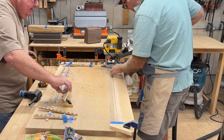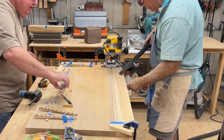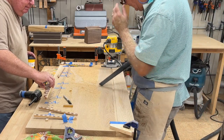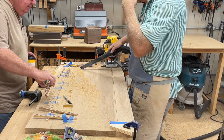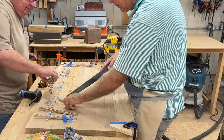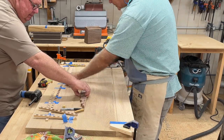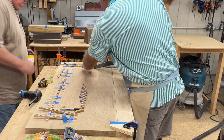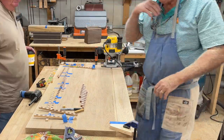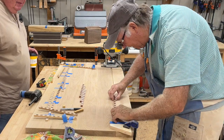Right here I'm pointing out where I had a little tiny variation. The router guide came off the back side of the table about a sixteenth of an inch — I could tell it when I was pushing it and pushed it back in. I decided I needed to get another smoother cut on that same spot to make sure there would be a smooth transition.